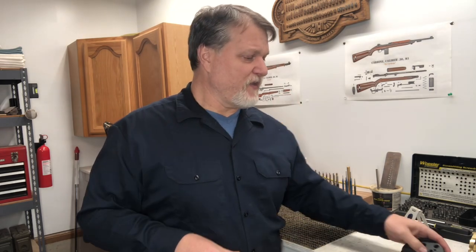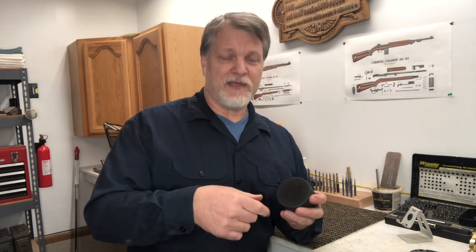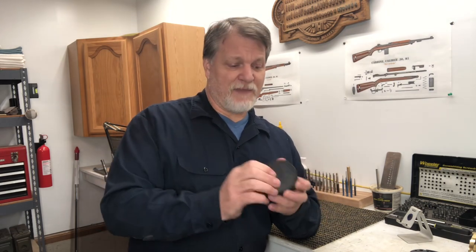But if you don't want to buy a block, or you want to make one for a specific gun, all you need is a couple of hockey pucks. We can drill holes in these to capture pins, and make a nice longitudinal cut through it to hold any kind of round stock from rolling around. If you don't have a mill, we can make that cut by clamping two hockey pucks together in a drill press vise and drilling down the center. I'll show you.